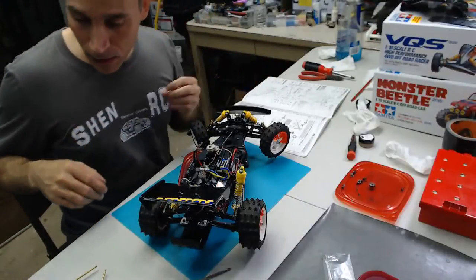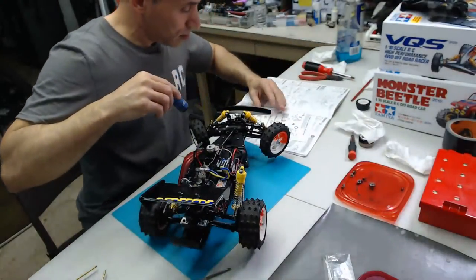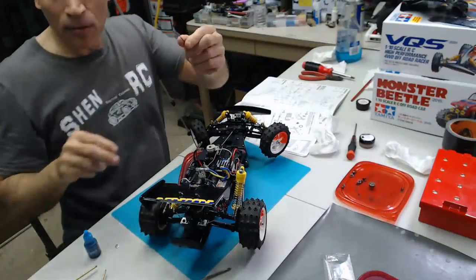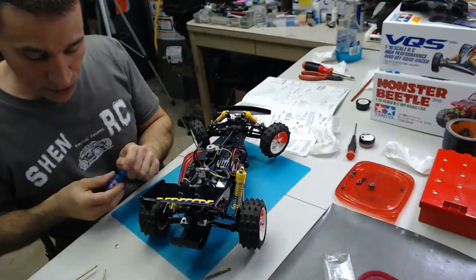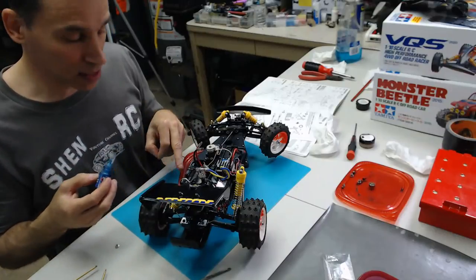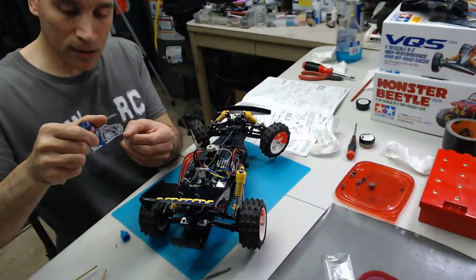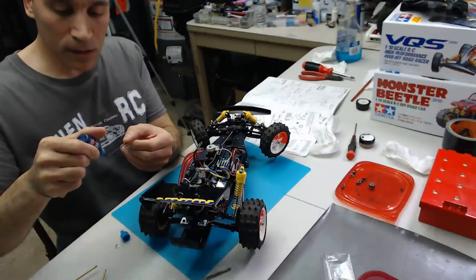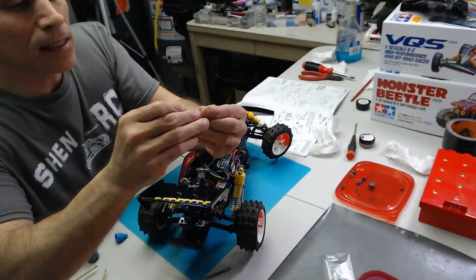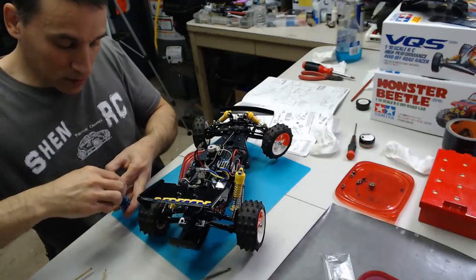Don't thread too far. I'm gonna use the method like I said before, where I just put it on a piece of wire. Where the hell did I put it? I'll have to use this one here. I get a little piece of wire like this, and I just put it in the threads on the bolt. If it's up against plastic, usually if you just put it on the threads and you screw it in, it'll get on this ABS plastic and then it'll just start cracking. So I put a little dab on here, just like that. And I go in the nut and I just put some inside it like this, so it won't get on the plastic. That way you won't have to worry about your plastic cracking over time.